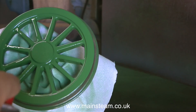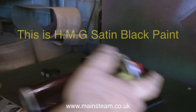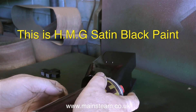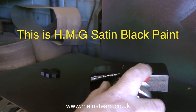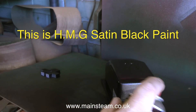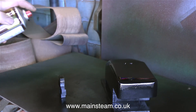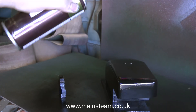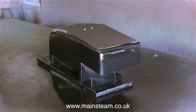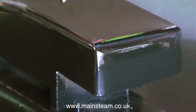Generally speaking, I do get quite a good finish and the finish is durable. The paint I'm using in this clip is not Precision Paints - this is HMG Satin Black. This is the paint that the Steam Workshop use for steam locomotives and it really does look the part; it's very good quality paint. I'm painting this as an experiment because initially I painted it with some paint called Hy-Coat - that's Hy-Coat spelled with a Y. I was curious to see whether this paint would react with the Hy-Coat, but it didn't and it gives quite a good finish.